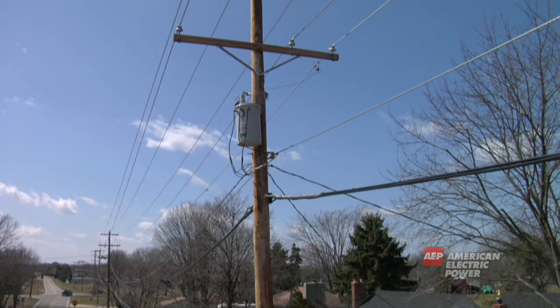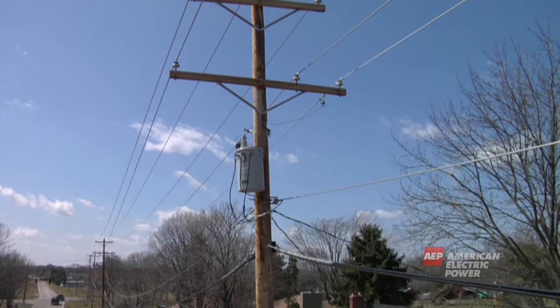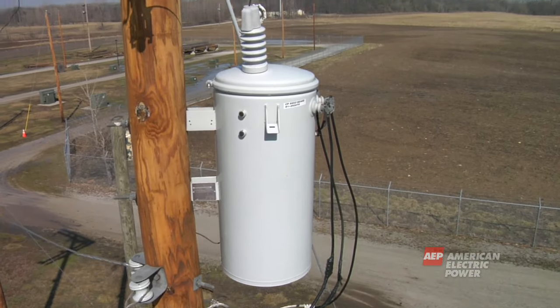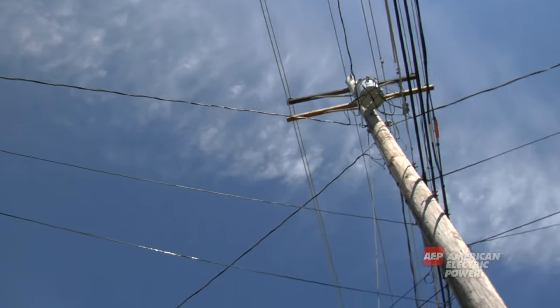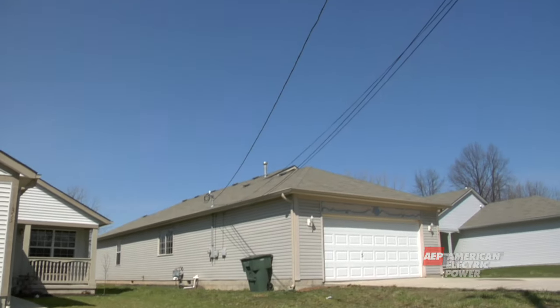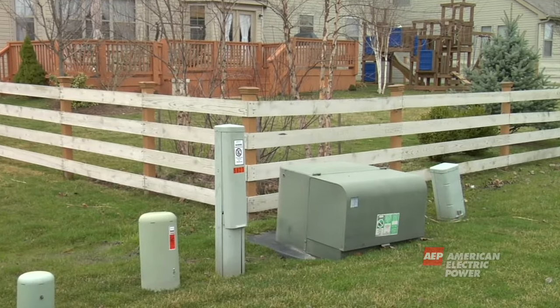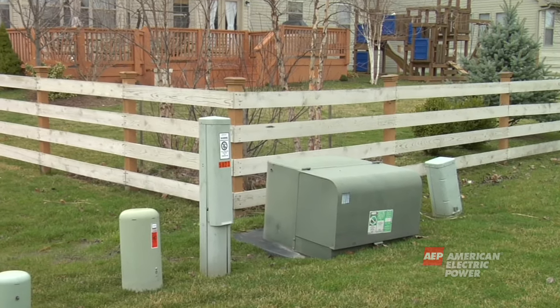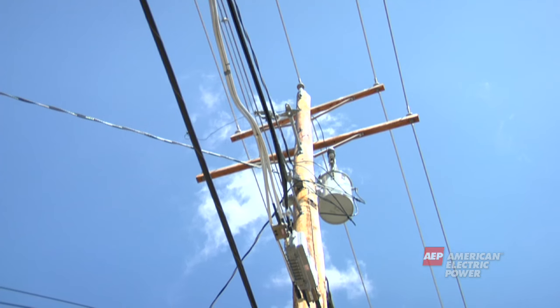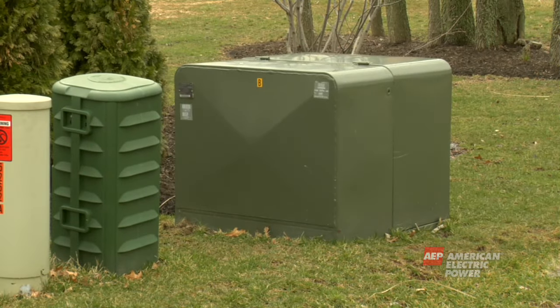Below the cutout is the piece of equipment that looks like a can — it is called a transformer. It takes the electricity from the wires at the top of the pole and steps it down to the lower level needed for a home or business. If the primary wires are underground, then the transformer is the green box often found in front, side, or back yards. So if you have overhead lines, you will have a pole and transformer; if you have underground lines, you will have a green box on the ground.